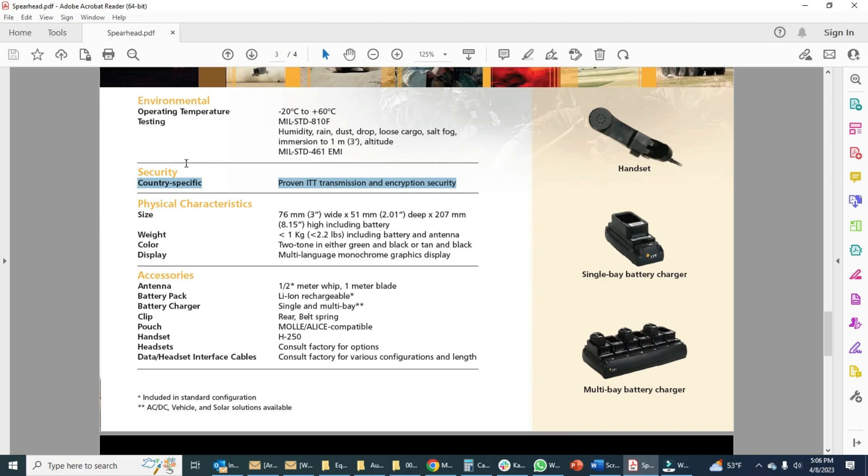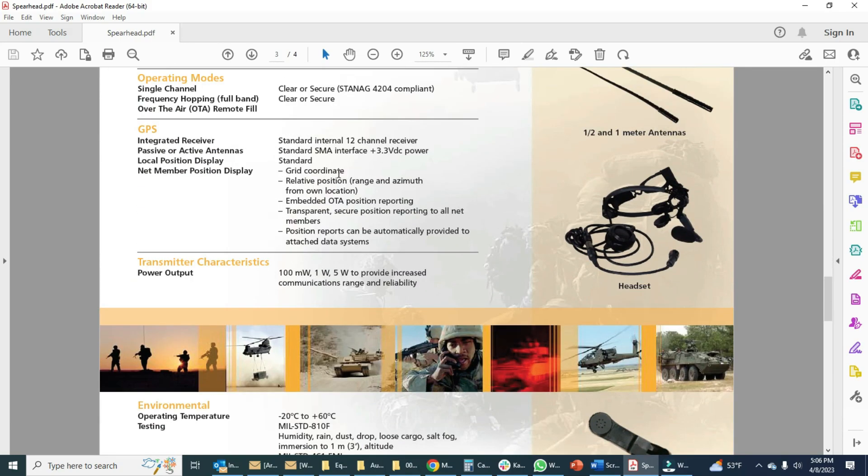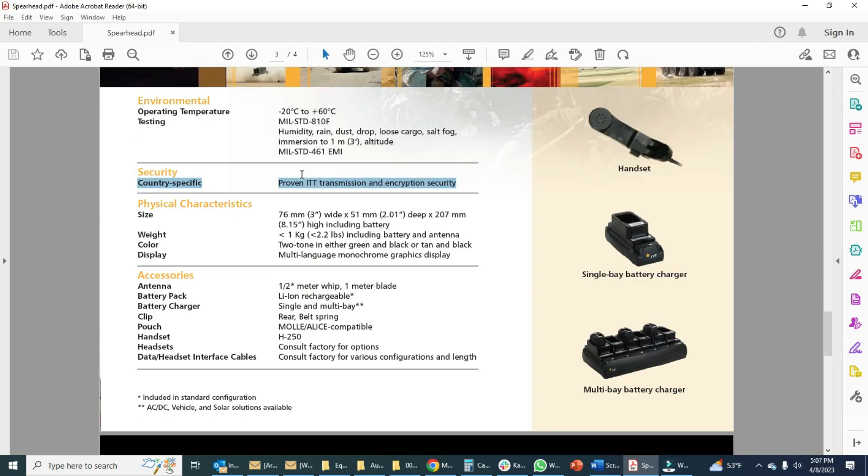Here's what's interesting — the security. They don't specify the exact encryption used, but it says country-specific. And this is the key: in order to get these radios interoperating with the situational awareness functionality, they all have to be from the same country. They have to all be EEPROM-programmed with the same country code, and the country code is used as an encryption seed. I was very lucky in that all three of these radios have the same country code — that's really essential. So the rest should be fairly straightforward. I'll have to go through the manuals, and on top of that country code seed I'll have to set up my own additional code — I think it's just a CID, I think is the term they use — and enter that into all three radios as well.